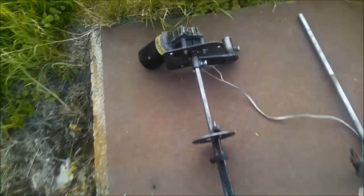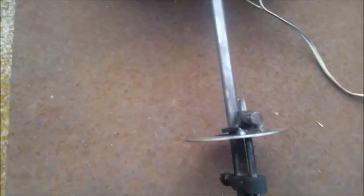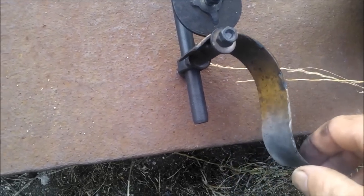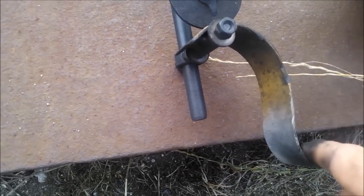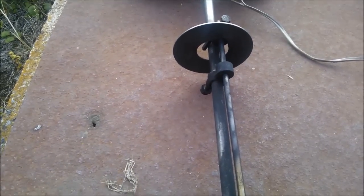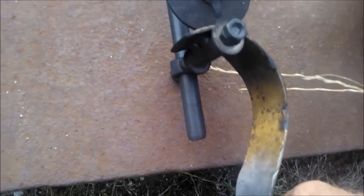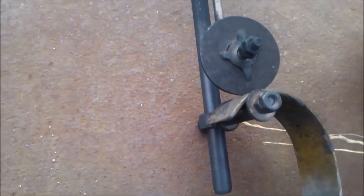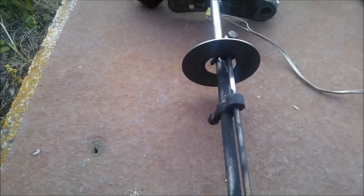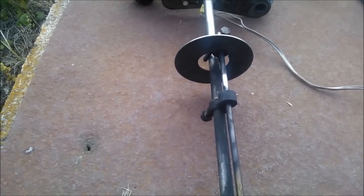It consists of two pieces driven by a windscreen gear motor. Here is a plate that, when it turns, always touches the micro switch. This is the actual movement — it's always going around and always evens up the zone. When fuel gets empty, it hangs down and that plate touches the micro switch. When fuel comes in, it turns upward, which moves a board that triggers or does not trigger the micro switch.